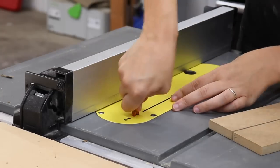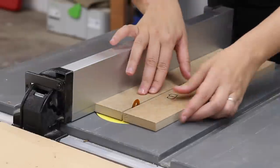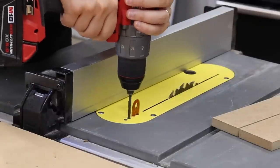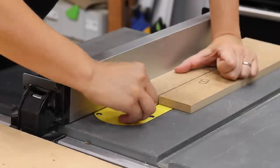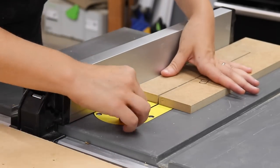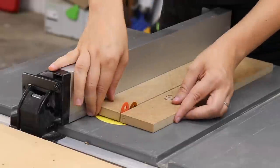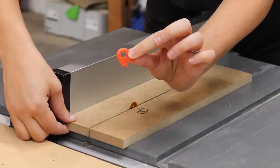Here's where that second setup board comes into play — use it to test which splitters you want to use, because they're all slightly different thicknesses. I'm going to use the kerf keeper, and the holders for it did not fit in right away, so I needed to ream the holes a little bit to make them slightly wider. After they fit in, I can put the kerf keeper into place. To show how this works: if there's tension in a board, it starts to close in on itself, the kerf keeper will lift up, and you can just turn off your saw and figure out another way to attack the cut.